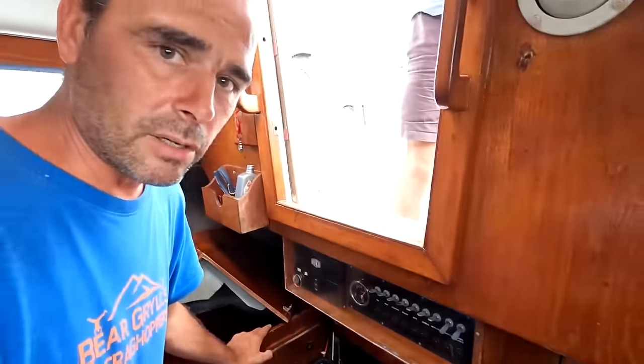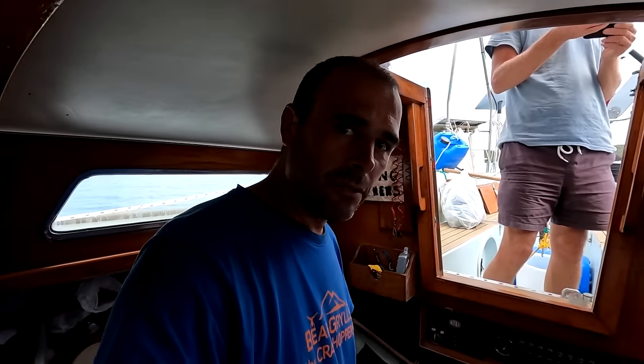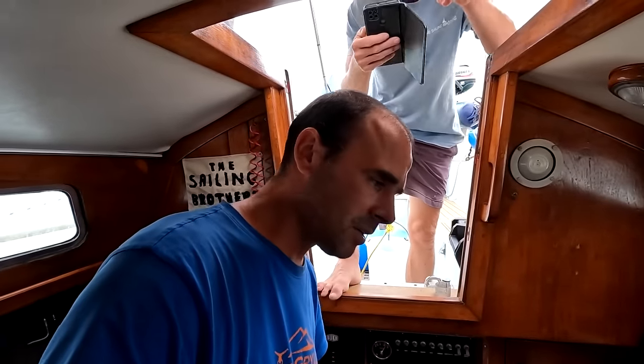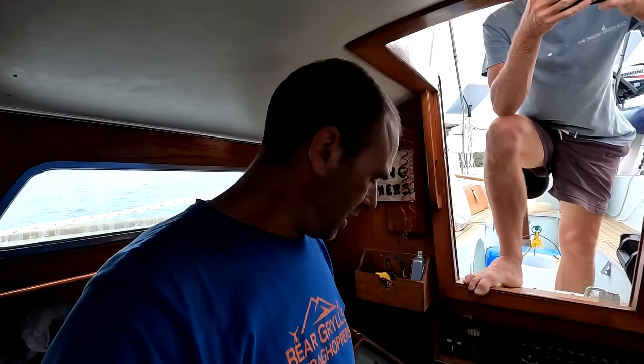And the last test we did was quite interesting. We've got an external regulator with this alternator. We bypassed the external regulator and used the internal regulator on this alternator. Results were interesting. Our starter battery's at 12.3 volts. With the external regulator running, it barely gets up to 12.5, which says the alternator's not working properly or the regulator's not working properly. Don't know which one.